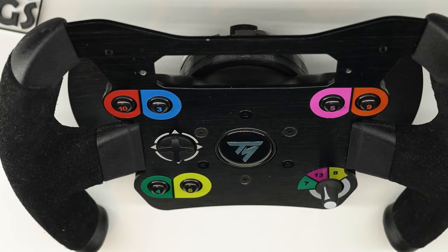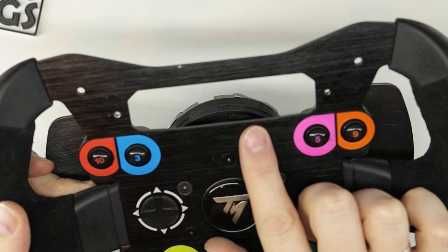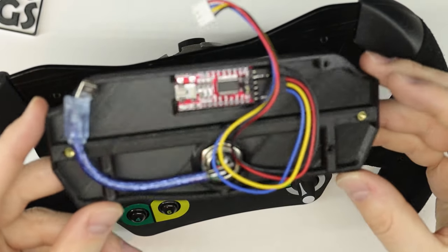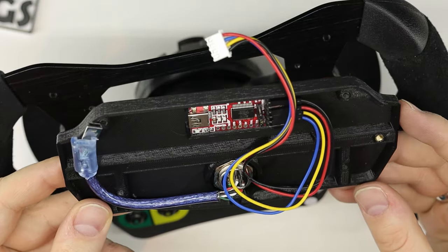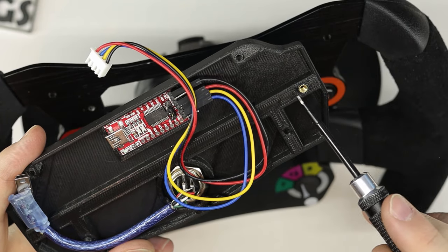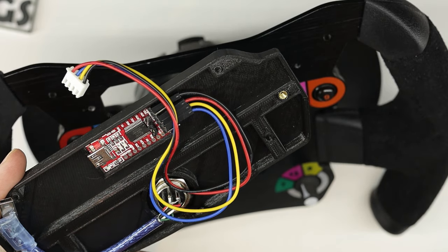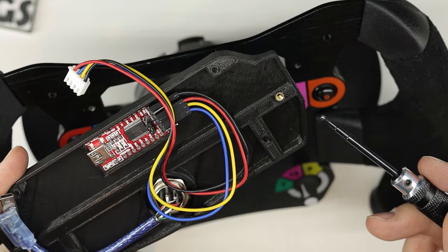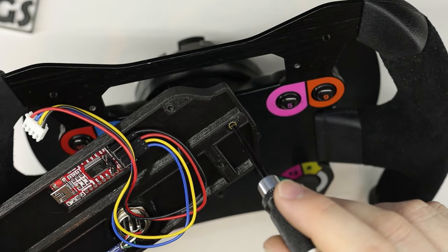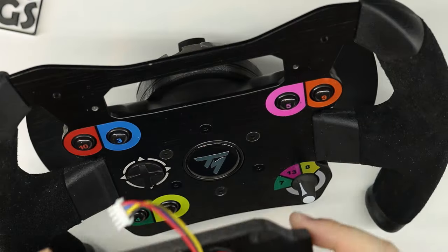For the open wheel the procedure is slightly different. First thing is to take off the front metal plate, which I already have done. Now we need to put on the back side of the display box. One thing to watch out for is that it has M3 inserts inside, which is critical for the mod durability. Putting these in is very straightforward — you simply heat up the soldering iron and just push it inside; it goes extremely quick and without any hassle.